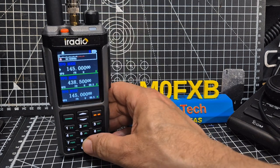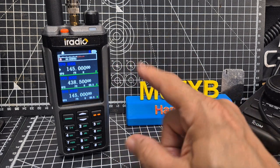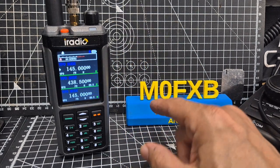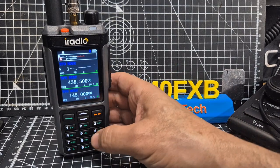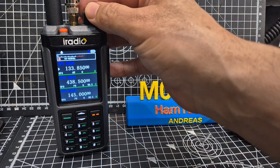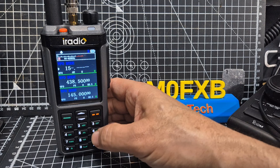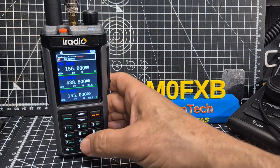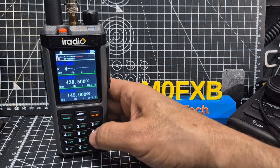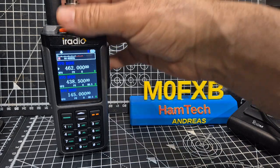When we talk Shack in the Box, we're listening to VHF/UHF ham radio bands and it works well — you can set your repeaters, CTCSS, plus/minus shift. Then we can go air band: 133.850. If there's an aircraft flying over we'll listen to air band. We can go 156 — marine band. 446 — PMR. 462 — GMRS. It's endless.